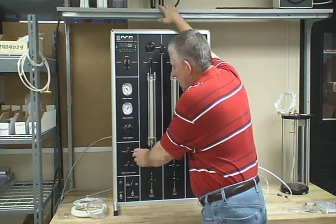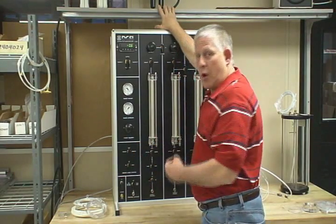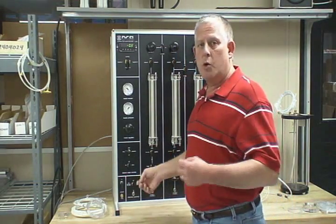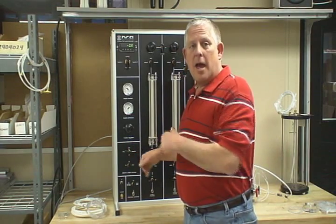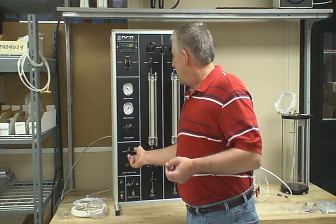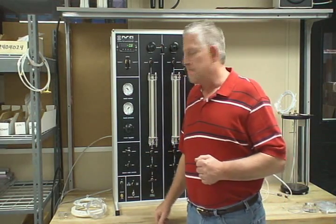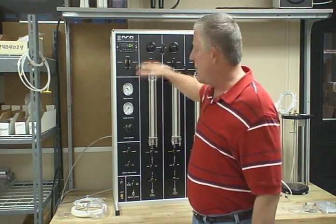A word of caution: there is a small regulator in the back, which I will show you shortly, that applies the pressure to your de-airing tank. When you are on vacuum, do not switch this valve straight over to pressure, because you will apply a vacuum to the small regulator in the back and damage the diaphragm. When you go from vacuum, you want to let it vent — which vents the de-airing tank — and once it's vented, then you go to pressure. If you have the de-airing tank above, you don't need the pressure; just put it on vent and it will gravity feed into your burets.